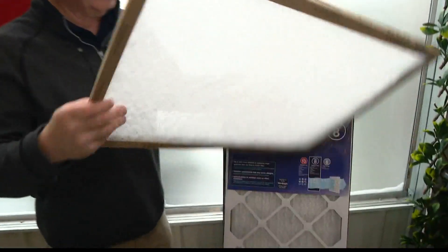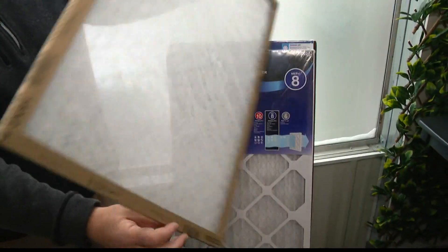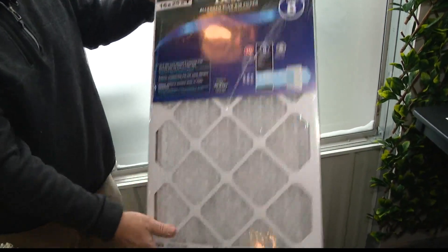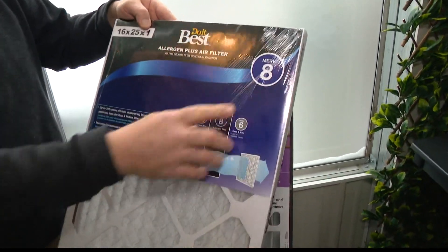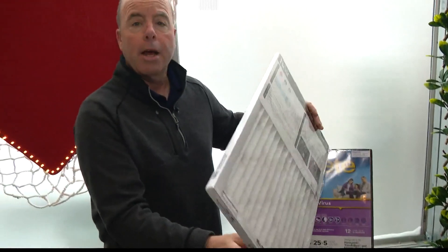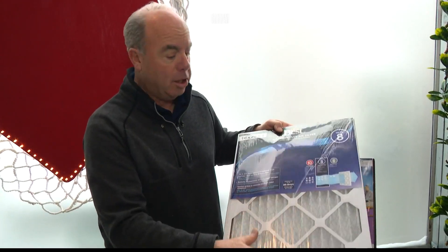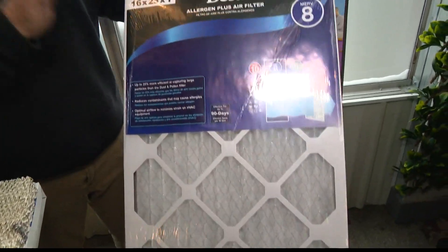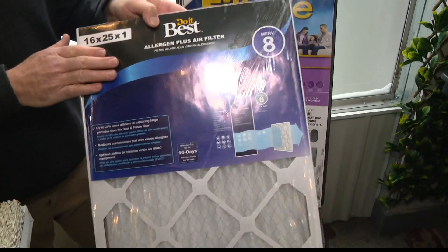Filter change — really important. This is just your plain old filter that pretty much does nothing. If you want something better, look at the MERV rating. All you need to know is the higher the number, the more filtration you get. You've got to be careful and make sure you change these because they are so efficient at catching stuff. I'm too stupid to use them, so I use cheaper ones — but you may be on top of the game.